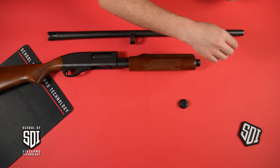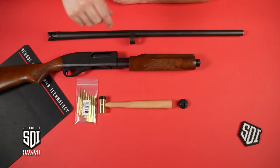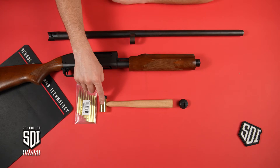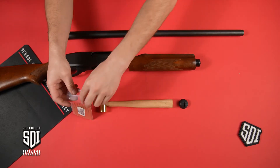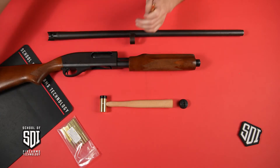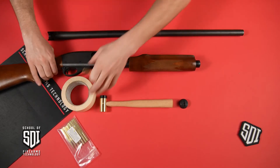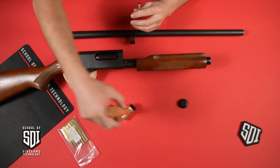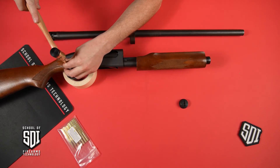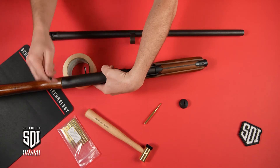You're going to grab — and you guys will remember from an earlier video, we did a review which we'll link in the description box below — we did an unboxing for one of our earlier courses where you'll receive a brass hammer and a set of brass punches. For this video, we're going to use these brass punches to take out these two pins here. You can use a regular punch block, but if one is not available, a roll of tape works just fine. Using finesse, we don't really want to whack on these pins — just tap them out. Both forward and rearward pins. If they don't come out on the backside, you just pull them the rest of the way out.